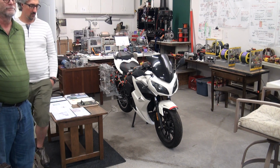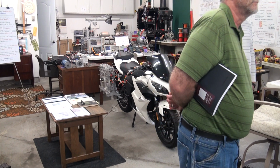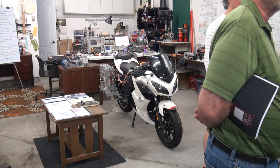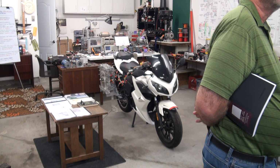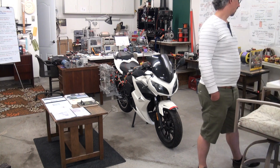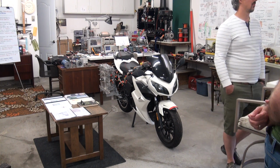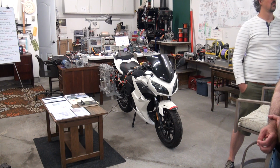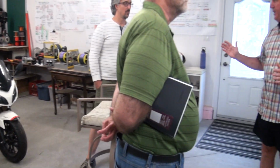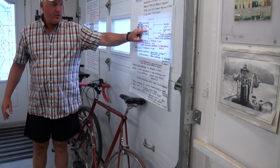So what you do, this is the coil's core. The first coil is 0.1 ohms, okay? That's a conventional coil. And these are the outputs. So you're selecting different outputs on the coil. Yeah, it's a multi-tap coil. So 0.1 ohms is a conventional coil. If you measure the DC resistance of this coil, it's about 0.1 ohms. That's going to give you the best motor coil operation. It's also going to give you regenerative braking at any speed, and the CPU is going to ensure that function.